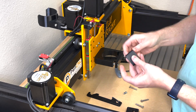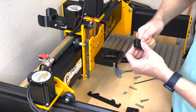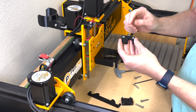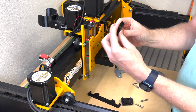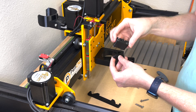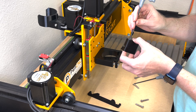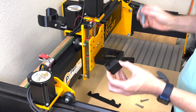On the left side, take the socket head screws and a couple of M5 locking nuts with the nylon pointing in the same direction as the L. Hold those in place — the L will be pointed towards the back. Take the L bracket, drop it in, and get those screws started. Once you feel the nylon resistance, stop and pull back — we'll tighten it down in just a second.